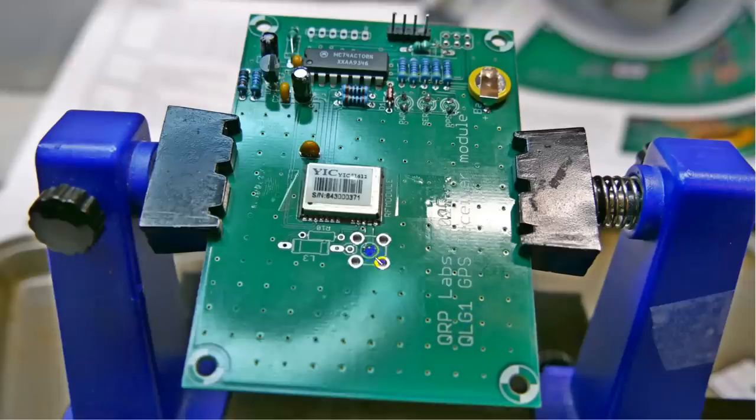Here you can see where I have soldered that patch antenna through right here. If you were to put instead in here a little SMA connector so you could put your antenna in a different place, you have to put an additional inductor and resistor in place that are not supplied. And you can see here the Scotch tape that held this thing down until that was soldered in place.